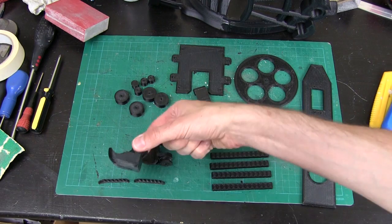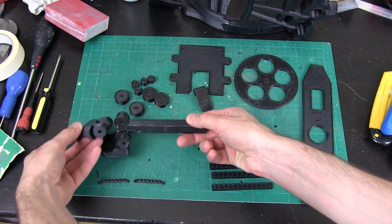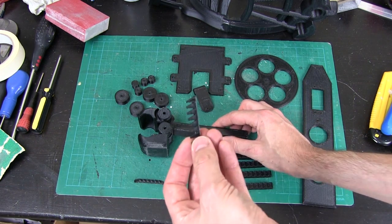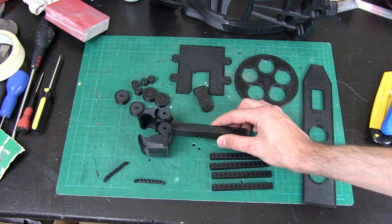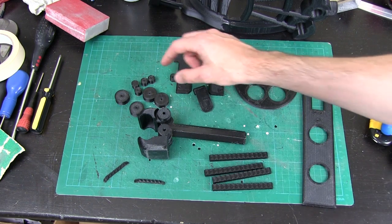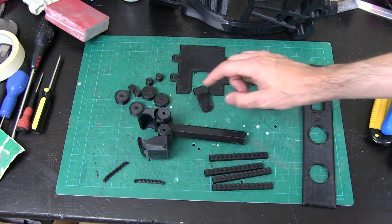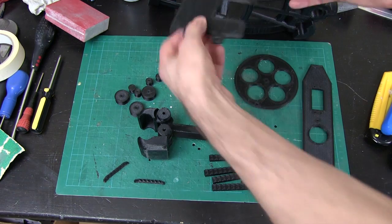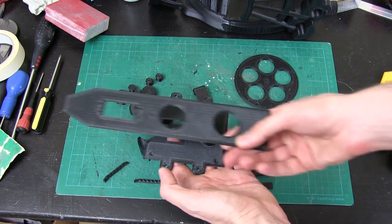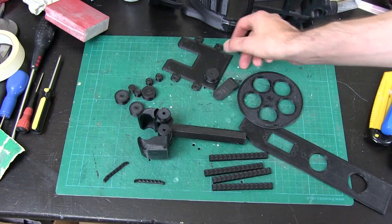Here are all my parts. I've got my bottom and top jaw which hinge on this thing — that's the bottom and it will hinge there to make the jaw scoop open and close. I've got these little teeth which I will paint up separately in silver and stick onto the edge. These knobbly things will go onto the chamfer as I described, and then we need to put together the whole roller assembly. The little rollers from the CAD drawing turned out to be too small because I got my radius and diameter confused, so I've printed some larger ones. Those should mount onto the holes in each corner to allow this thing to slide in and out. Then we can have a go at putting the wheel on and its holder piece — let's get some acetone out and start sticking it together.